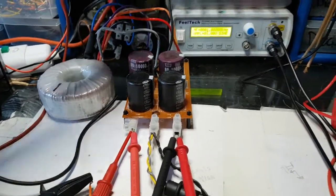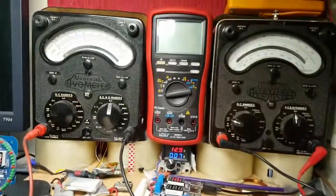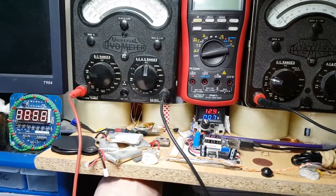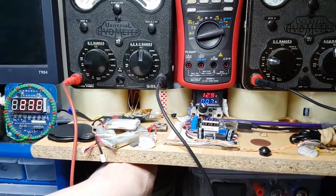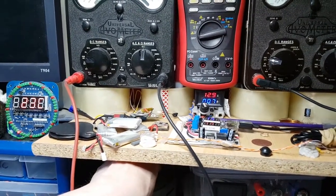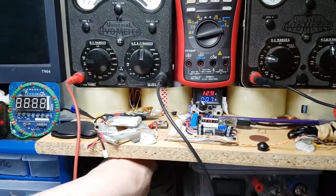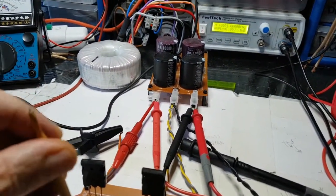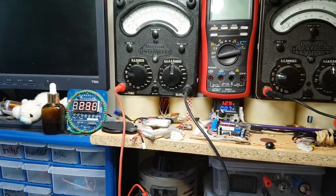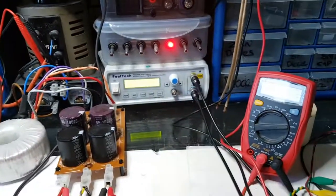Okay, right. Oh, put the power down. Probably a good idea. And let's start going up. So we're on 12, 14, 15 volts. 30 volts. I want us up to 50. And we're hardly using any juice, so really at 50 volts there, where's my little biasing twiddly tool? I'm just going to see if we can adjust that bias. Not really got anything going on there, so I'm just going to turn that power down.